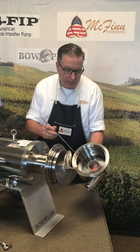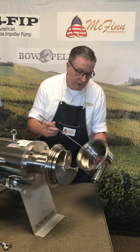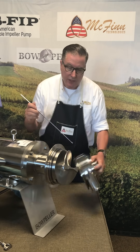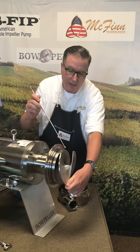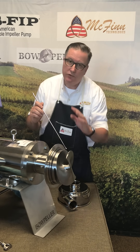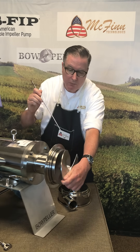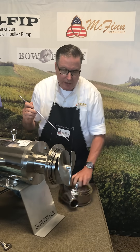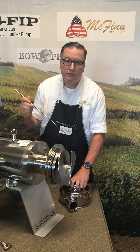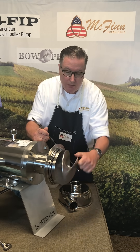There are actually two chambers inside this casing. The first chamber the impeller sticks into acts like an inducer, helping pull solids into the pump. In the second chamber you can see the impeller design itself. Solids come in, liquid comes in, and the product is protected on both sides. In most pumps you don't have that — the product gets slapped. In this pump, the product is gently accelerated and then dumped into a circular volute in the second chamber. That volute adds efficiency, making this a very efficient pump ideal for this process, and then the product is pumped out.